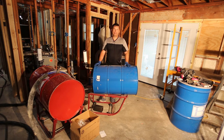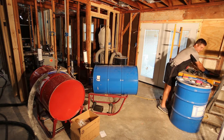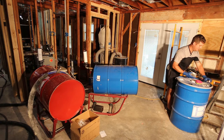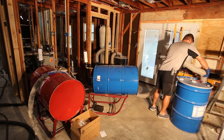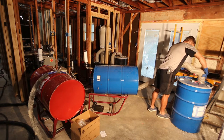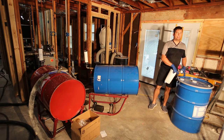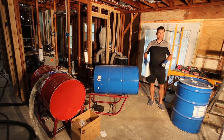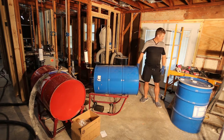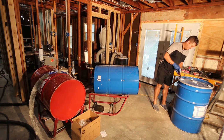I have applied closed cell spray foam and I'm going to change over to open cell spray foam — this is actually a drum of open cell spray foam here. First things first, I'm going to get all this junk off the top of my drum. I've used my dust collector to get all the foam dust off the top. I don't want to contaminate the polyol. I've got some paper towels and some thread sealant, and first I need to break the seals on the drum, so I'll use a heavy-duty pair of pliers.